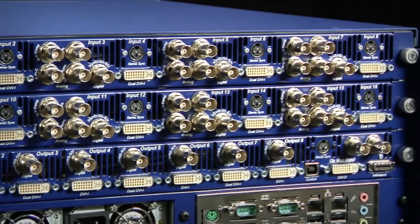Your typical AV rack is going to have a matrix switcher. This matrix switcher may be just DVI. You may have another matrix switcher that's your component analog, and another that's your HDSDI. Why do you have all these matrix switchers? Because you have a great variety of sources that are different formats and different resolutions — analog and digital — that all need to come into your rack, and from there they go to destinations, which could be projectors, LCD panels, or recorders.